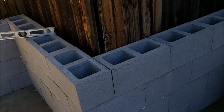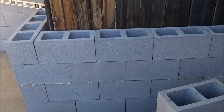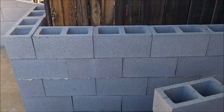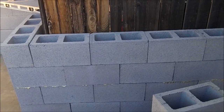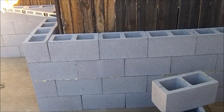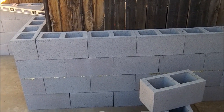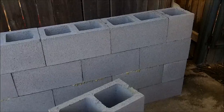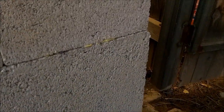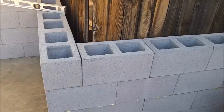The other thing I've noticed through this process, that's probably another reason why people use mortar or cement, or whatever it's called, between bricks, is that no two bricks are the same height and no two bricks are the same length. Whereas with this glue process, you would prefer to have more consistency. As a result, I have one brick over here that's slightly longer. It doesn't matter because it will get lost in the process once it's stuccoed over. The stucco finish will hide all that.